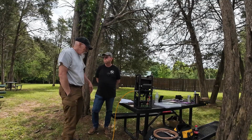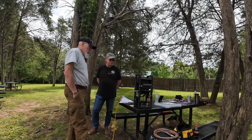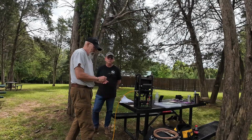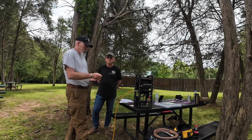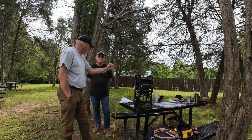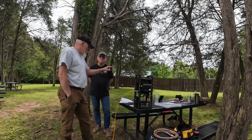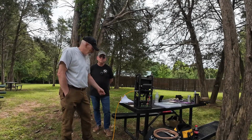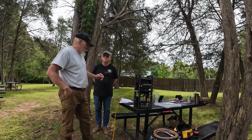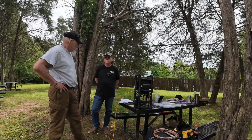Yes. And having that start time written down helps, because you mentioned you have an 18 amp hour battery back there, and you sit at home and do your math on how long you can operate on 70 watts off an 18 amp hour battery. Then you can take this POTA sheet and look at the start time where you started calling CQ and your final contact time, tally that up and say, okay, I operated for 1 hour and a half, and write that at the bottom of your page: 1.5 hours of operation. Then you can look at your POTA sheets and determine, oh, I better charge my battery. It's been 3 outings and I haven't charged it.